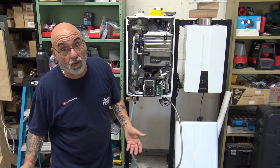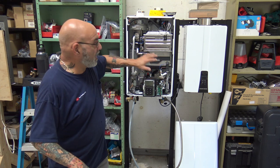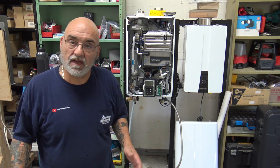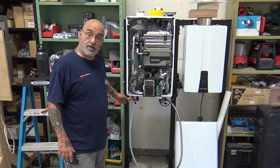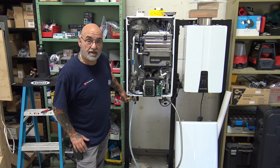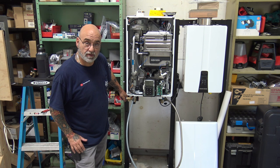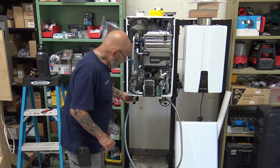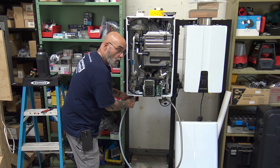Look at the time — 45 minutes. Once that's done, unplug the pump. If it's an interior unit, get a bucket underneath if the relief valve isn't piped outside. Pop the relief valve to get as much solution out as you can. Now take off your hot water hose first, because it's going to drain back into the bucket. Once you have the hot water service valve off, drain out your hose.